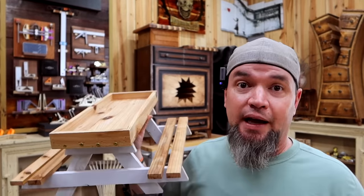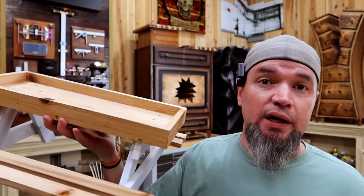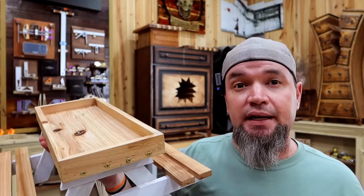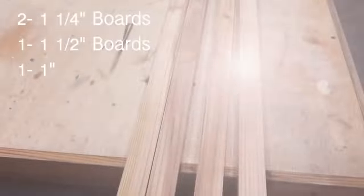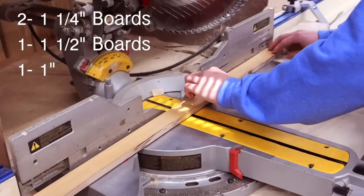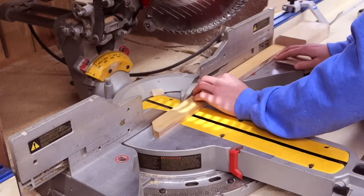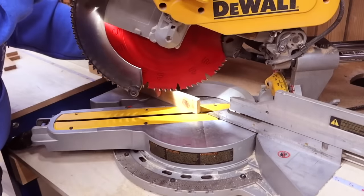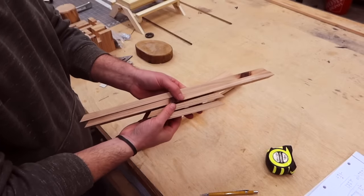The best thing of all — one fence picket. You can build this for two dollars. I showed my son how popular these were and how expensive they were going for, and of course he went into production mode — this is one he made. I'm going to tell you every single step. For anyone who wants plans, my son and I sat down and made those; they're in my Etsy shop, link in the description. Take your fence picket and rip it into four boards. For the tabletop you'll need four boards 16 inches long, two at seven inches, and two at 17 inches, with 45-degree angles on each.